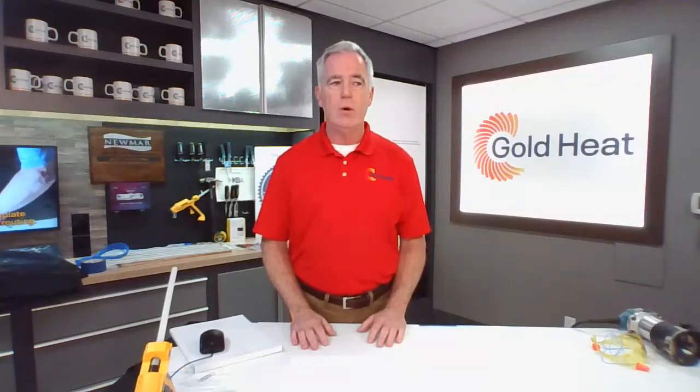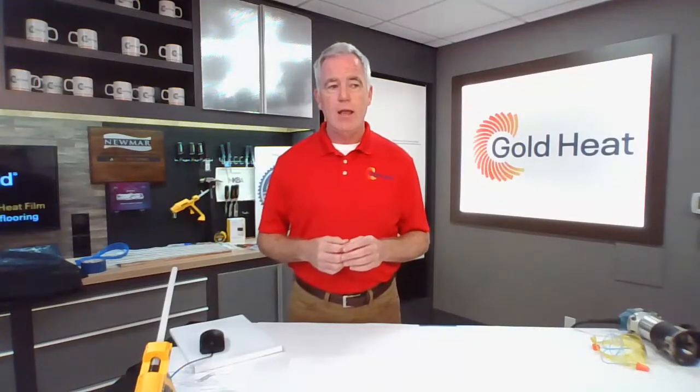Sheet flooring. So you have a bunch of different kinds of sheet flooring, and there's a great advantage to sheet goods in a tiny home environment. It's a floor that you can put down first in the whole space and install everything after that on top of it. Your built-in fixtures, cabinets, shower, built-in beds, all that stuff. You can put in a seamless floor over the entire unit. A lot of travel trailers are done that way. And there's an advantage to that.